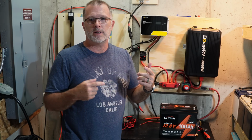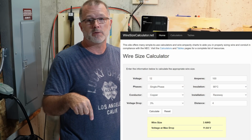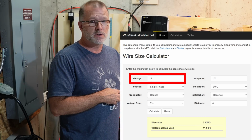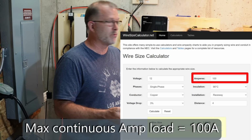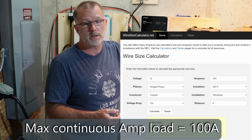And there are actually easy calculators online, and I'll put a link to one in the description below if you want to go check it out. But all you need to know is what the source voltage is, and that is the battery voltage. So in this case, the source voltage would be 12 volts. And then you need to know what the maximum load is going to be. In this case, it would be 1,000 watts. Again, pretending this is a 1,000 watt inverter.